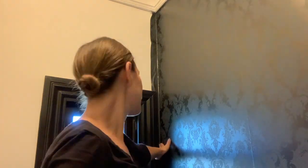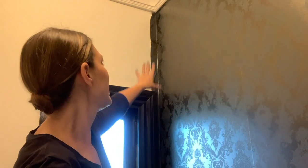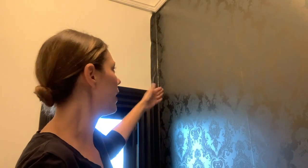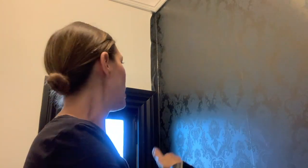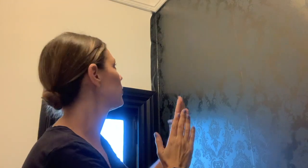Also here, since there's a little lip between the windowsill and the wall, I decided to give myself an extra inch and have it wrap around the side. It actually just fell right into that little gap between the windowsill and the wall, and it worked out really nicely — I don't know how I would have cut that small piece otherwise; it would have been really annoying. So that actually looks really flush and nice. I'm going to go ahead and cut it back, leaving maybe one eighth of an inch on this wall, so when I put the other panel over there won't be a white line and the pattern will match up nicely.